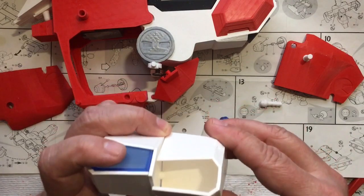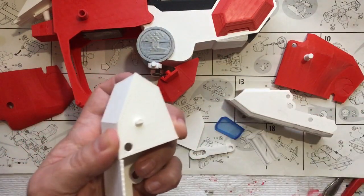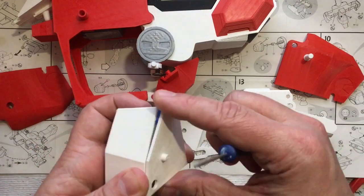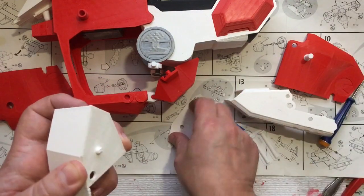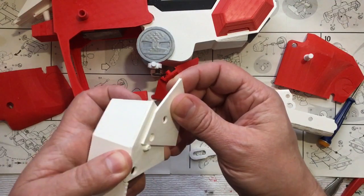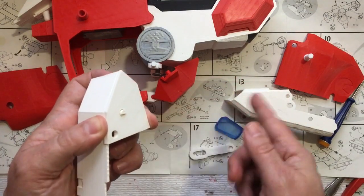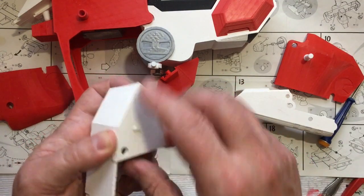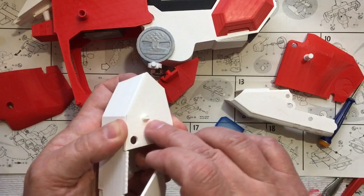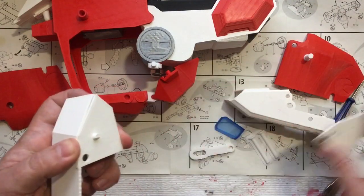that wall here. So what I think I'll do on the CAD, it really doesn't have to be that long. It really only needs to be as long as the thickness of the next plate. So I'll just shorten that down in the CAD instead of moving it. By shortening it down so it's flush with this one, it won't interfere with that other piece. So I'm just mentioning it in case you notice that mine's trimmed or cut. Yours you won't have to mess with, you'll be fine. Okay.